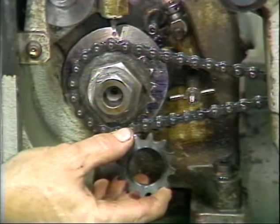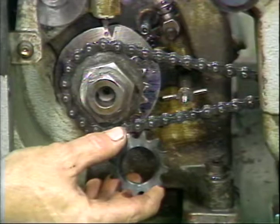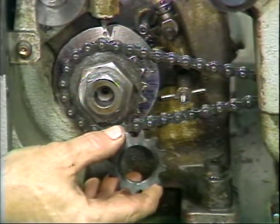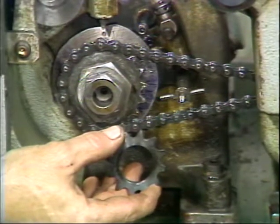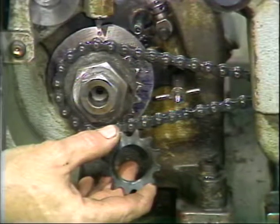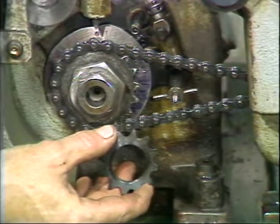At the same time that you change the tool cams, the stock straightener camshaft ratio should be checked. Since the single sprocket wheel and chain are removed to replace the tool cams, it will be easy to also change to a different single sprocket wheel if necessary.